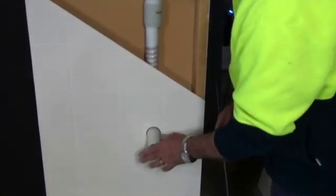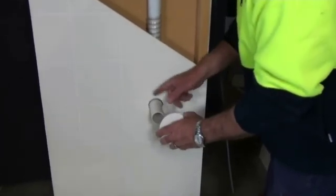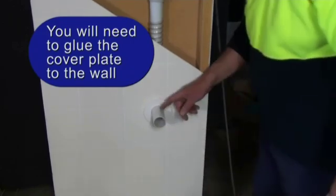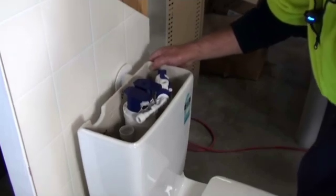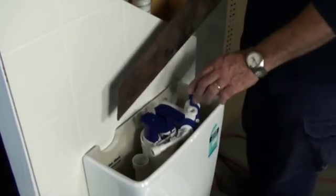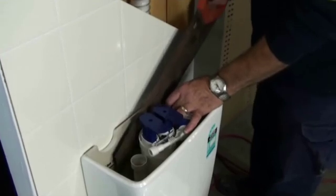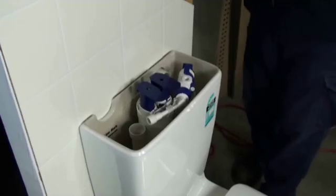Next, we need to put that small length of 40mm PVC into that, once it's been glued, and then insert one of the cover plates over the pipe. Once the pipe's through the wall, we just need to insert the pipe through the back of the system, as on our display. Now we'll just trim off the piece of pipe inserted through the back of the system, and pull it out.